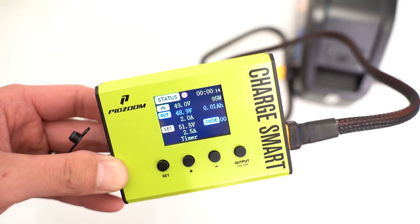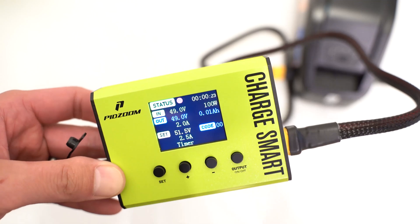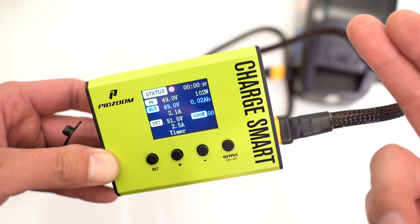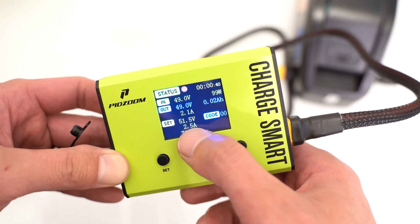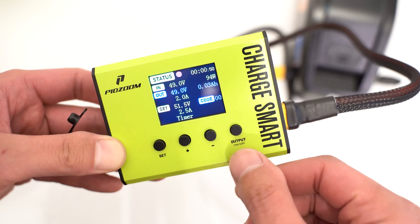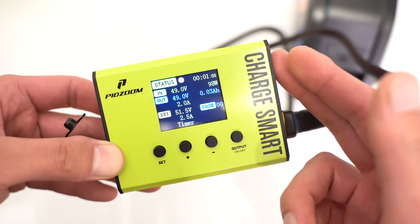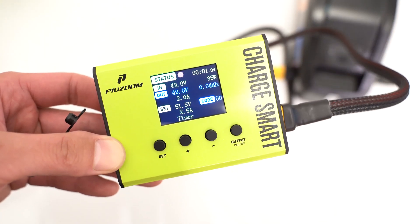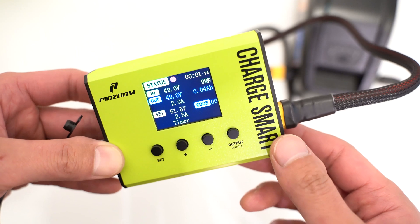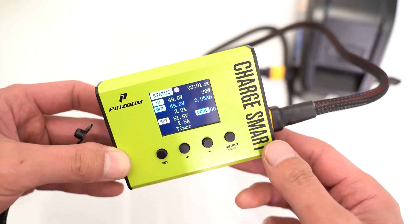Overall I think this product is very useful because there are always horror stories of batteries getting overcharged and exploding. You can set the charge percentage to prolong battery life, charge to 50% for storage, control the current output, set a timer, and it stops charging once the battery is full. You can also measure battery performance over time. I think this is a very cool device to help supplement your e-bike battery chargers. Check out the link in the description, please like the video if you found it helpful, leave questions in the comments, and subscribe if you want to see more. Thanks for watching and take care.